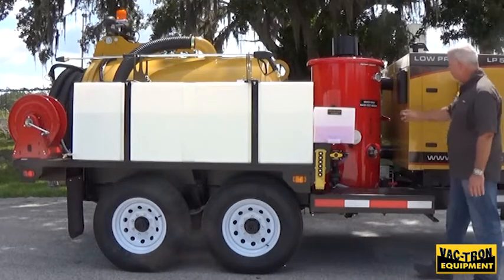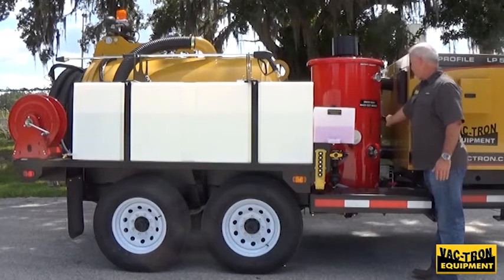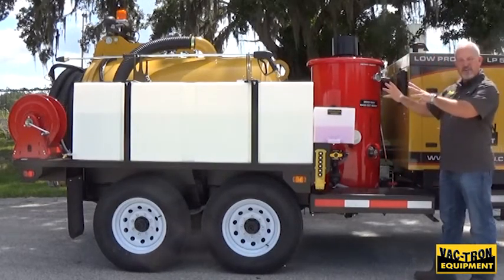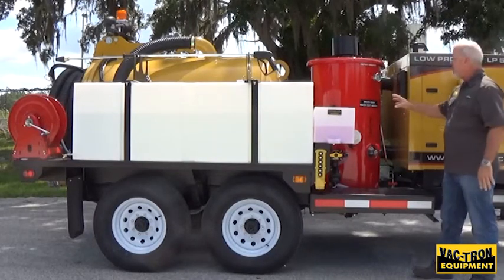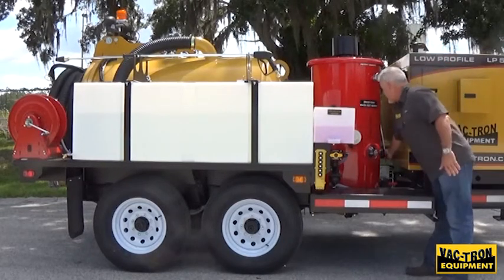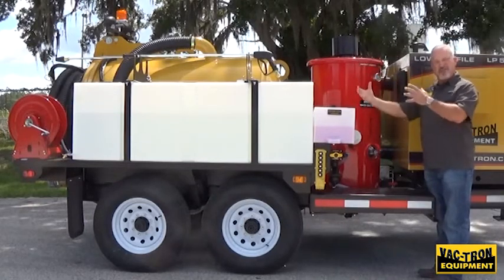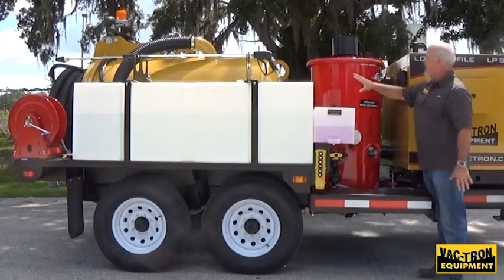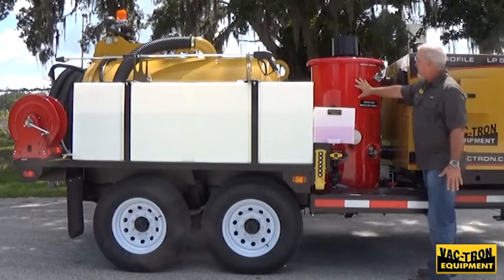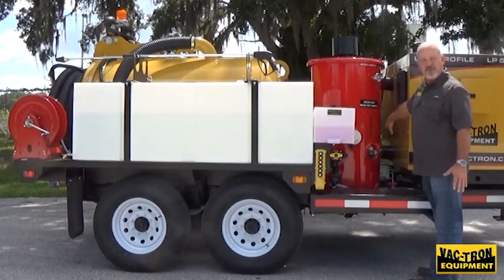You can also change your vacuum from here — vacuum to neutral and then to reverse pressure — to offload liquid materials from the tank, to purge the vacuum hose, and also to purge your filtration system under pressure. When you put it under vacuum, you're pulling vacuum onto the tank and you're working, sucking in through the vacuum hose and filling the debris tank. All your dirty air out of the tank is coming through this filter housing, getting cleaned down to a half a micron, and then passing back through the vacuum pump.